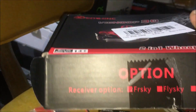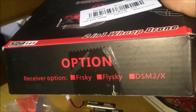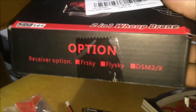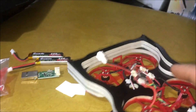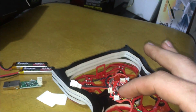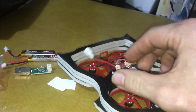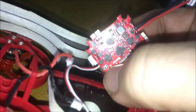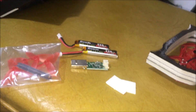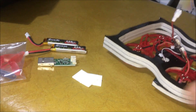Mine is FlySky. You can get it in FlySky or DSM-2. You need to be able to bind this to a controller, and with it stuck down like this the way they had it, you can't get to the bind button. If we flip this over, right above my thumbnail is the bind button. So you're going to need to bind it to the controller, and then use more double-sided tape to stick that down.